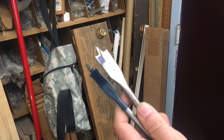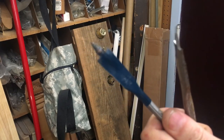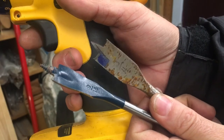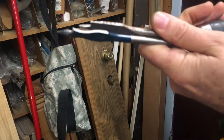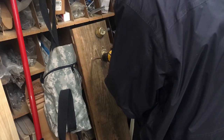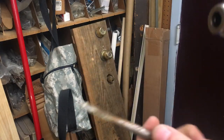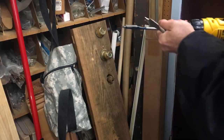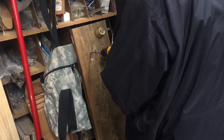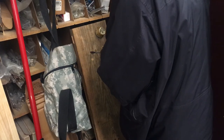Arguably the best of the two spade bits — I have a major issue with spade bits that have a screw tip. Compared to your standard spade bit, with a standard spade bit you apply pressure and you drill into your surface. With screw-tip bits, you push, it starts to feed, it grabs like a screw, tries to split the wood, and then pulls you through.